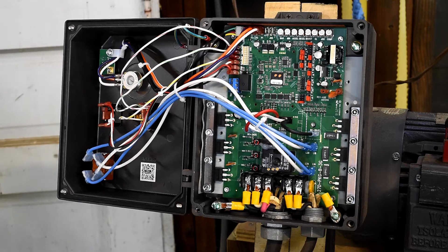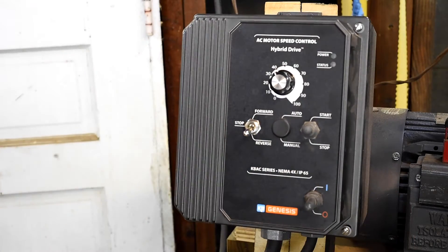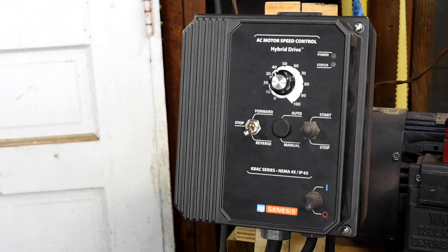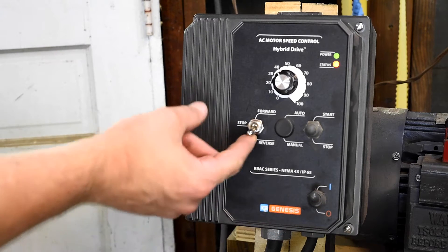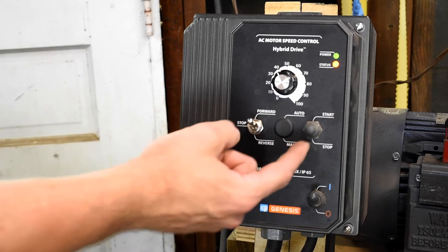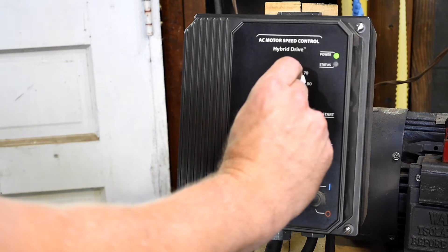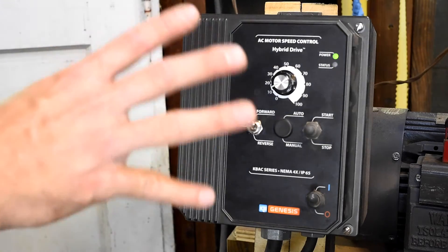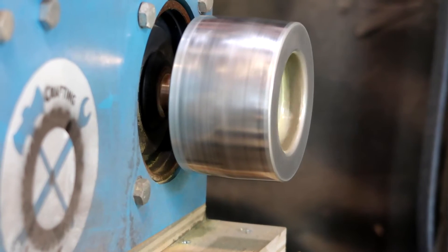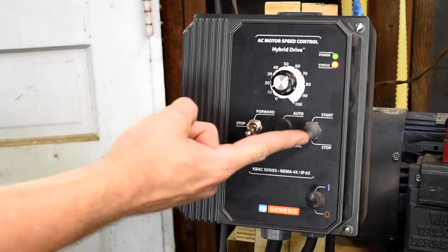So now I'm going to plug it back in. We'll close this just lightly, plug it back in, and then I will test the motor and make sure the switch is working correctly. This is the main power — I'll clip that on. The switch we just installed, I'm going to put that in forward, and then I'm going to hit start. So at this point it's functioning, but it's going the wrong direction — so this is reverse for my motor. I'm going to try the other switch orientation to see if it switches direction. I will stop, put my switch in reverse, which is two notches down, and then start.